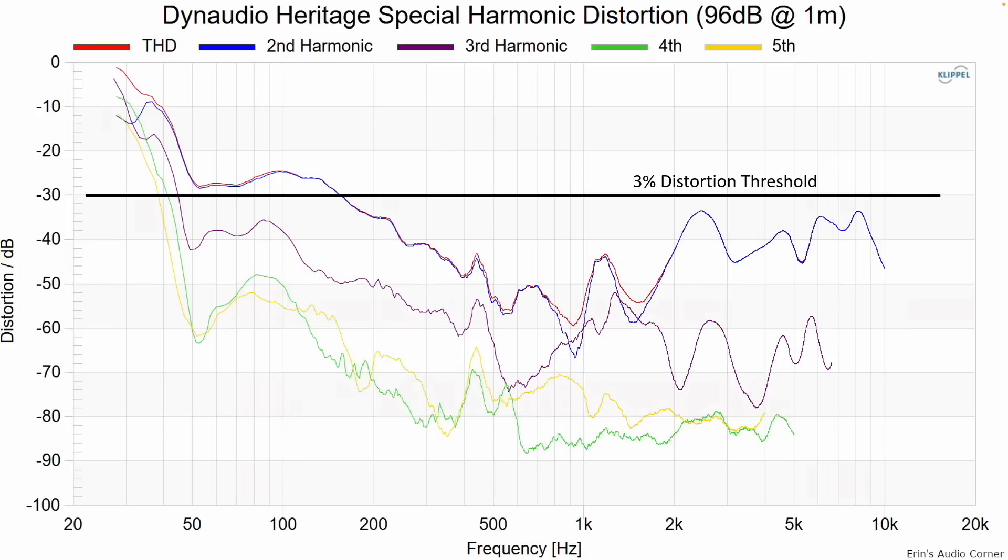Harmonic distortion at 86 dB at 1 meter — okay, now we've got some problems. The harmonic distortion of the woofer is starting to increase, but notice it's all second order, and there's about 15 dB of separation between second and third order. Generally speaking, even though distortion is higher on the lower end, being so well-separated from third order distortion, you're probably not even going to notice it. And I think that's why I didn't have a problem with the speaker playing at loud volumes.